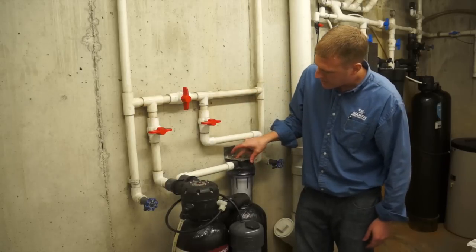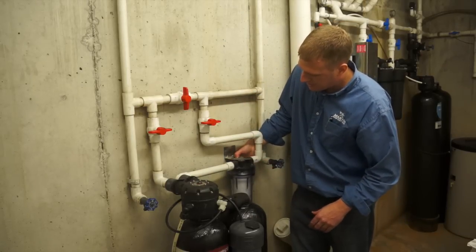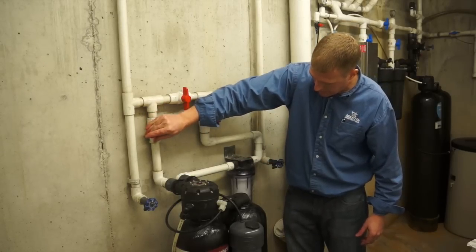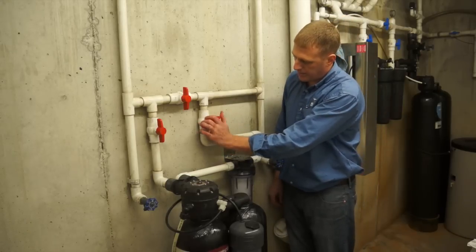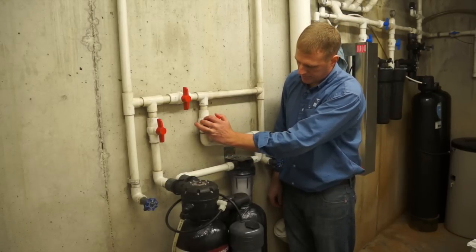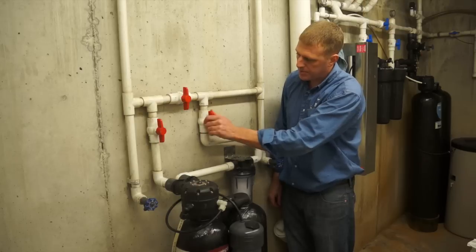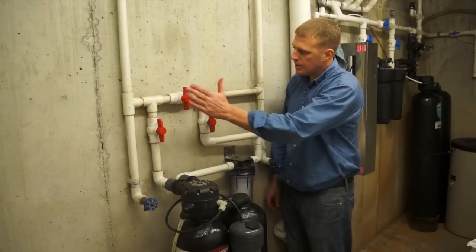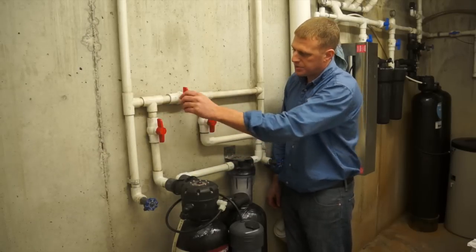And I like to press this pressure release back here. It's going to just release the pressure. Alright. After that's done, turn the valve on the whole way, turn the outlet valve on. Notice a little bit of air that was still left in there, no big deal. That'll go out of the faucets. And you're done. And just double check our valves: bypass closed, inlet, outlet open, and we should have water in the house.